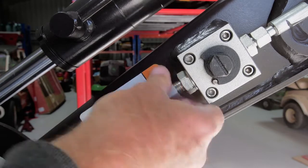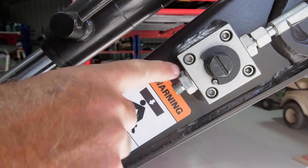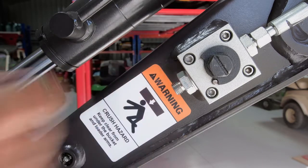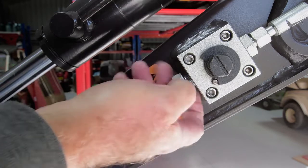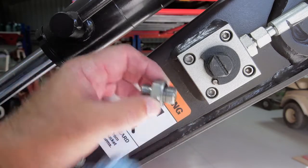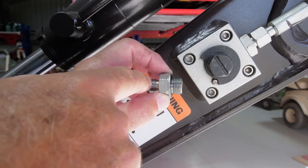What we're going to do is the conversion process — it's really quite quick. The first thing we're going to do is replace this part only, and this is called a hydraulic nipple coupler. I've loosened this off with a spanner so I'm just going to spin it out. When it comes out you can see that it's actually got two different sized threads — a bigger thread on this side and a smaller thread on this side.